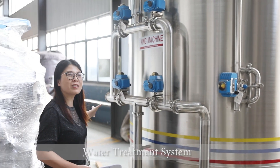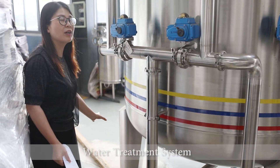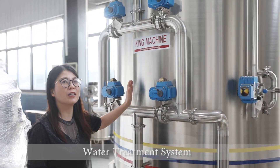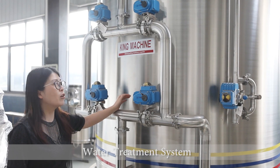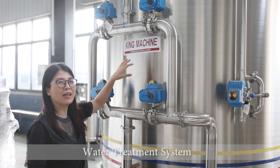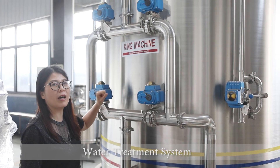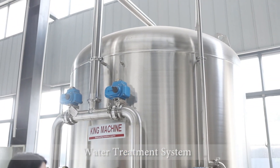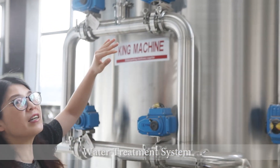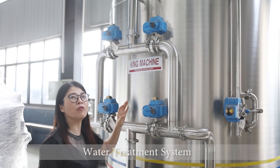After this water source tank, here we have a tank and a pump. The pump connects with the sand filter here. So the first filter, we call it a silica sand filter. Three different sizes of silica sand will lie inside the tank — small, middle, and big size. We can see that this filter has a round-shaped head, which is much stronger than a simple folded head.